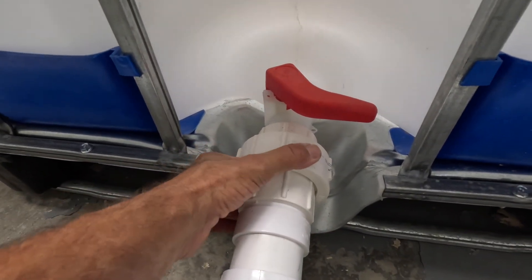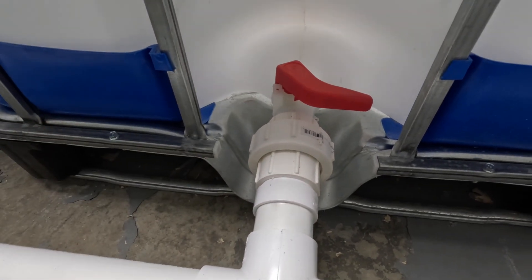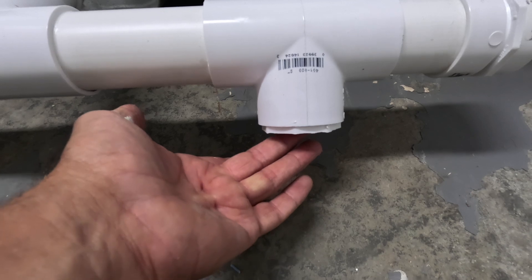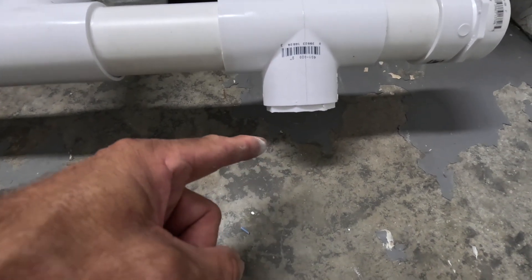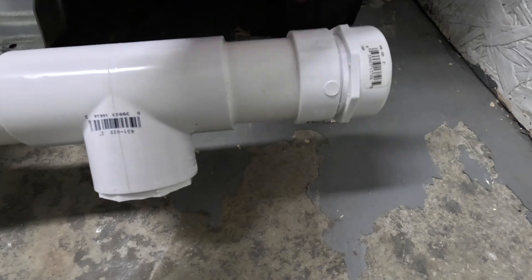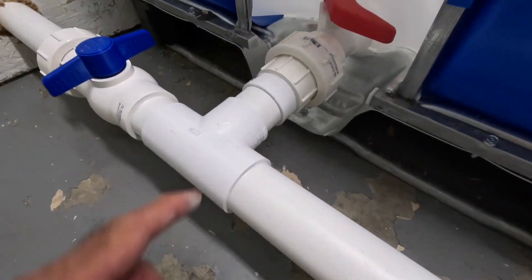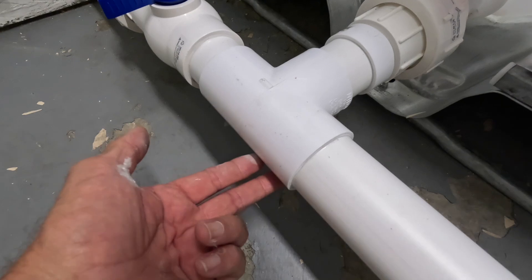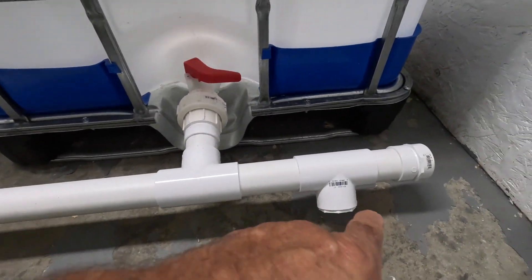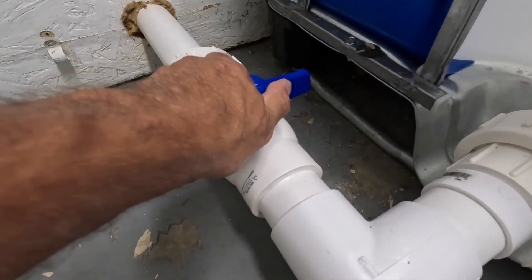Coming out of that, we have used some 2-inch unions — threaded unions that screw right onto the male thread coming out of the tank. We've got it into a T, runs over to another T, and this one has a 3/4-inch adapter or pipe thread on the bottom. This is where we will pull out our sap to run to the reverse osmosis. We added a cap to the end of it so we can take it off and clean it. Both of these tanks are plumbed together, and we draw off in one spot down here where the RO is going to hook up. We've also added an inline shut-off valve there.